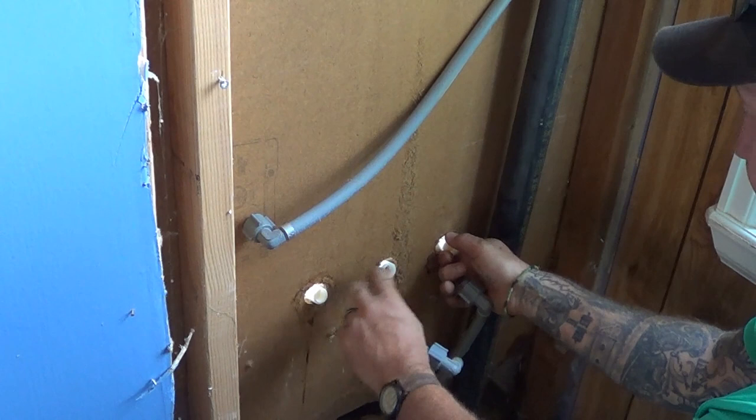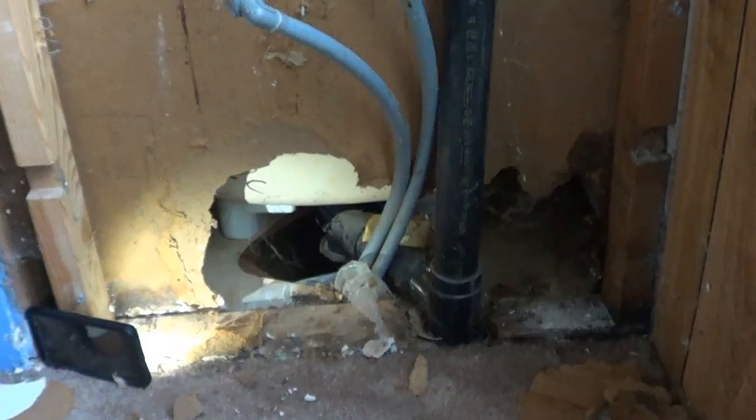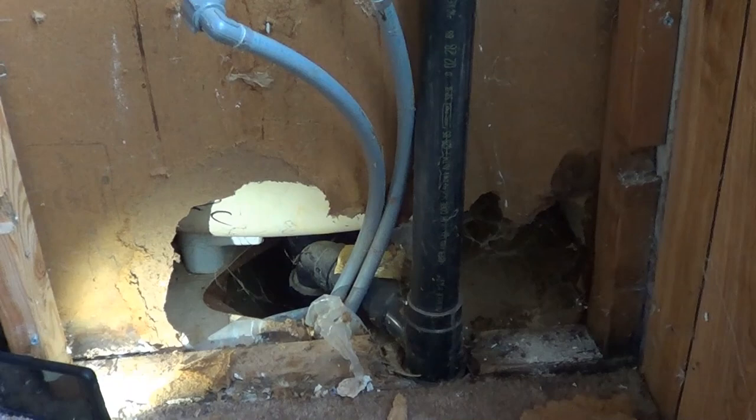Finally it comes off, and then we can be careful — someone on the other end to catch that is great. One of the main things in getting the bathtub out and back in is trying to save the integrity of the drain system. We don't want to just yank and pull and pry — we want to do that very strategically.